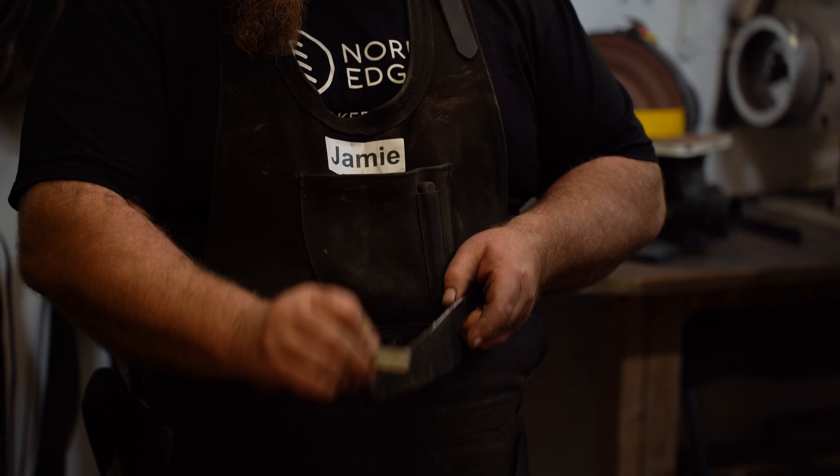All I need to worry about is the amount of pressure and the height of the stick against the edge. As I'm grinding, my stick is down a certain amount from that edge — say 10mm — and it's going to run 10mm all the way along that edge. With your knives, if there's a bit of a dip, I'll still keep that blade level because this section is still touching. Equal pressure at both sides and consistent stick position down that edge keeps your geometry correct.